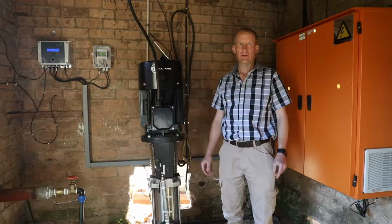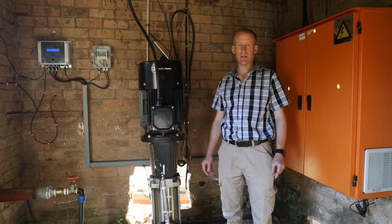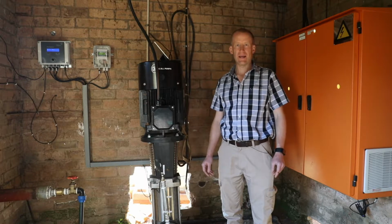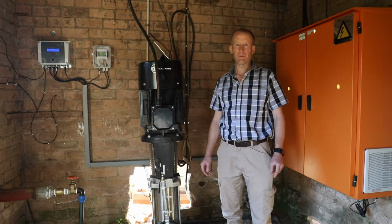the system. The physical installation includes installing the remote pressure monitoring stations at the center and end of the pivot, installation of repeaters if required, and then in the pump house, installation of the variable speed drive, the Pivot Optimiser main unit, as well as the associated sensors, including the inlet pressure sensor, outlet pressure sensor, and flow meter.